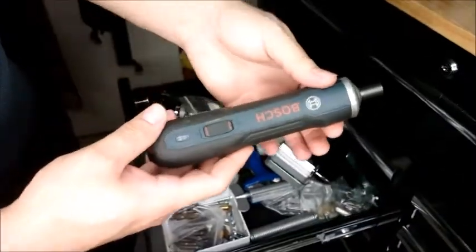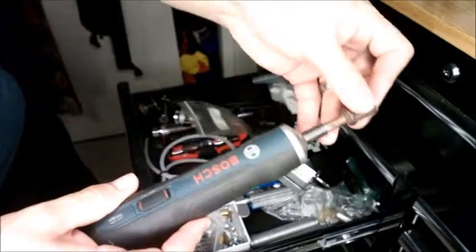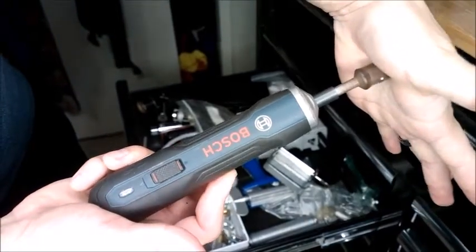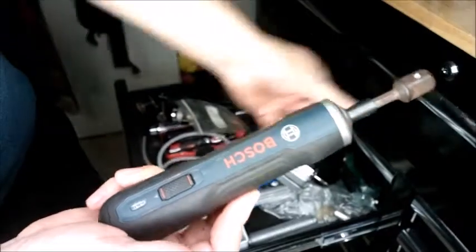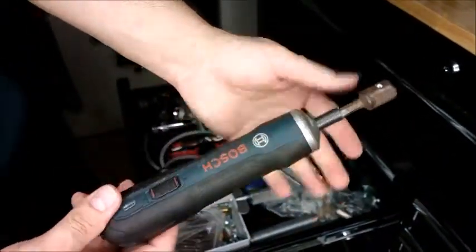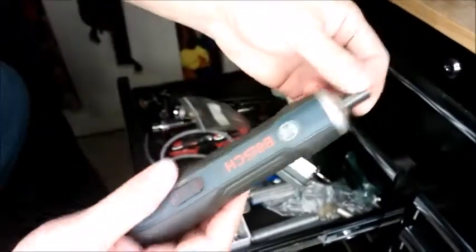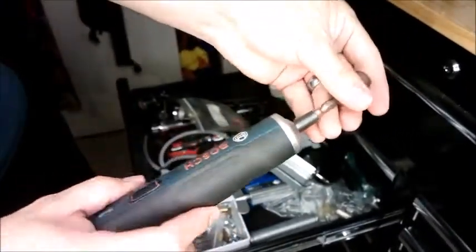Electric screwdriver. This I actually really like. The thing that people hate about this, which I actually like, is what engages the motor is pressure on the tip. You just choose the direction. It takes about 45 minutes to charge the battery. The battery will last about a half an hour. It's pretty good. When it's in the central position, like not forward or back, you can use it like a regular 1/4-inch screwdriver. The transmission locks.